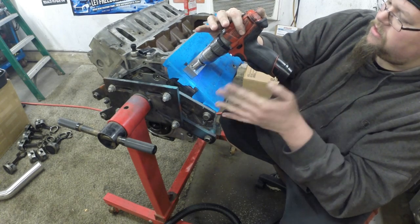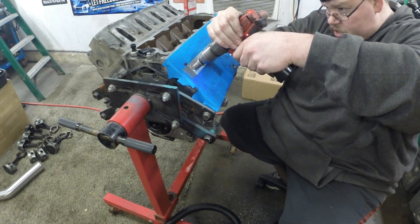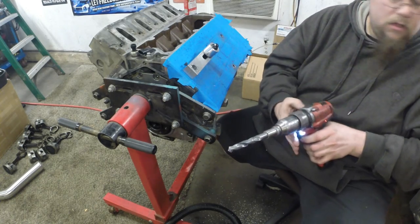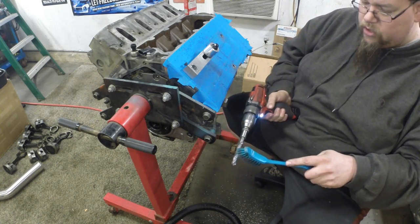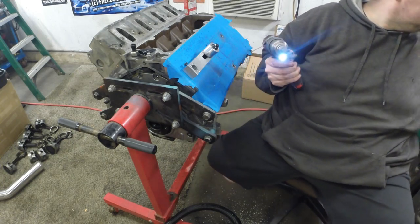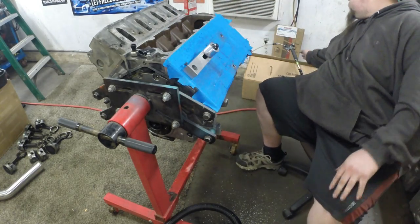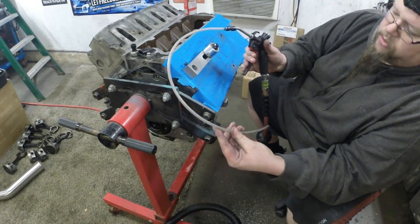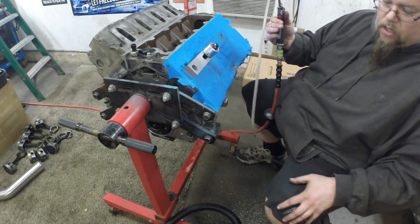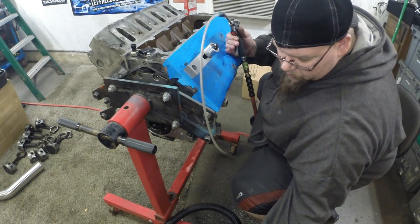Now you can hear that - once I got to the bottom of the hole, the drill motor just leveled out. You can tell it's not pulling anymore, and I'm pushing down on it and it's not doing anything else. That was very good of them to do that; it just makes things simpler. I'm going to brush the drill bit off - you're going to want another brush to try to keep everything brushed off and clean your drill bit. You're also going to need some compressed air to get down into the bottom of the hole and blow the chips out. The shop vac also helps a lot.